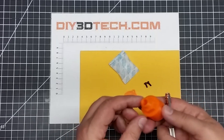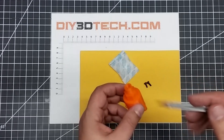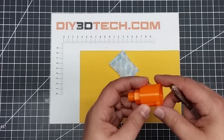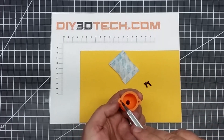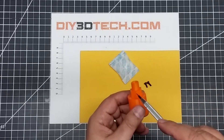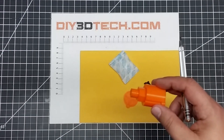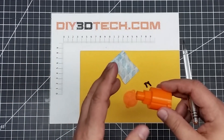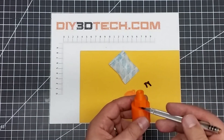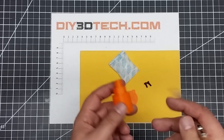What I did is I made a body and put basically a hex nut type structure here for a couple of different purposes. If I needed something to cinch onto to tighten it, I could do that. I also put these ears on it — they do double duty for mounting the cover as well as acting as a means to turn it. I can also put a wrench on it and twist it in. It's PLA, so it's not going to take too much torquing, but it really doesn't need it. This also provides additional support — if I took this right down to just the body it'd be kind of weak, so this acts sort of as a fillet as well as giving it something to cinch to.